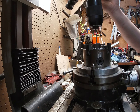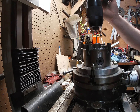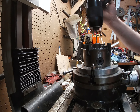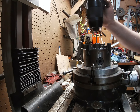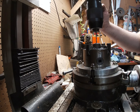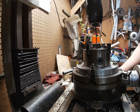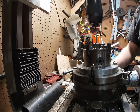This is just a chunk of one inch steel stock. Most of this piece is not going to be here once I get done with it. After this I'm going to drill and tap the hole, put a screw in there so I can throw it on the lathe to turn down the outer portion and get rid of most of the meat of this part. After that hole is drilled, zero the X and we have to go 9.36 over.